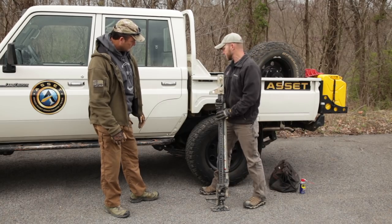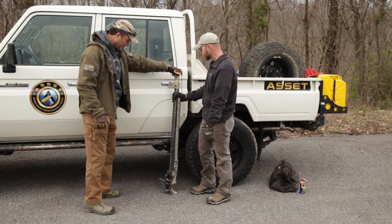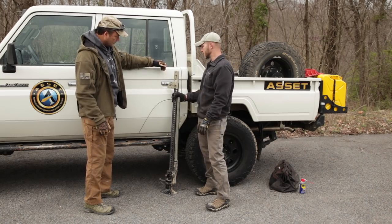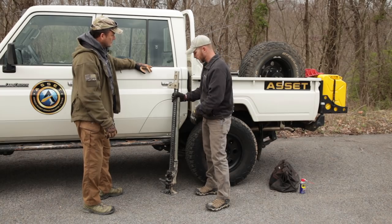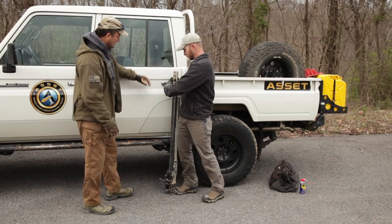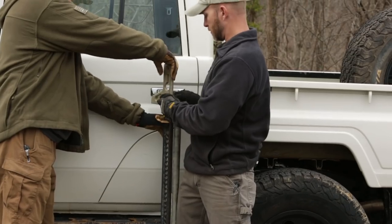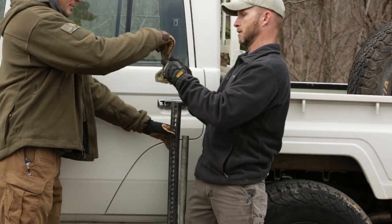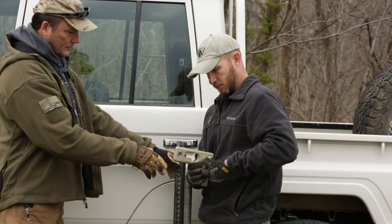When we go to put it in position to lift the vehicle, we pick a spot — just for demonstration. You'll notice the top clamp: there are quite a few pieces on these jacks and it's common to reconfigure them for different uses. In this case, if I'm about to lift this vehicle I don't want to scratch the door, so we'll take the top clamp off and use a zipper bag to hold all those pieces so they don't get lost in the field.